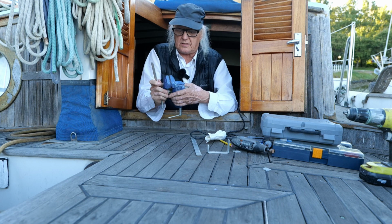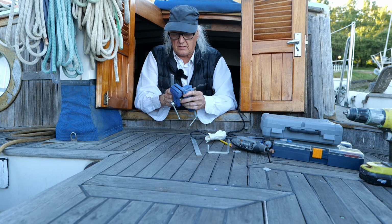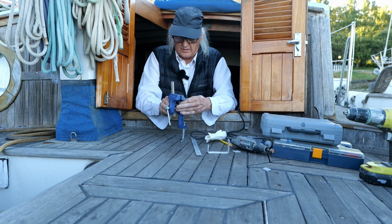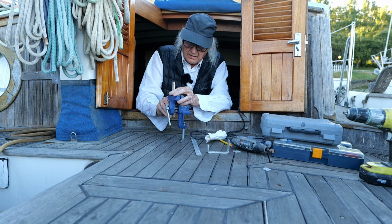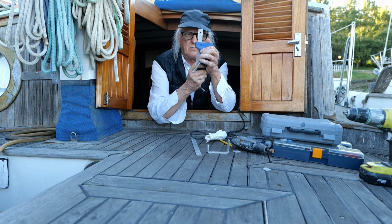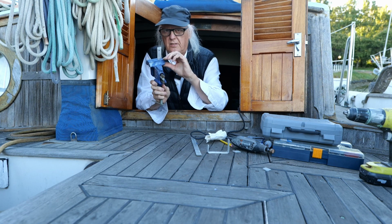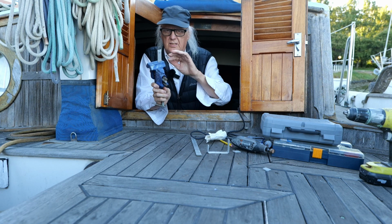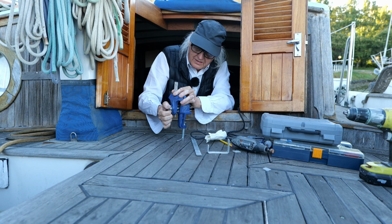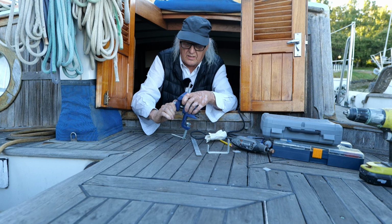So let's see which way would be easiest. If I'm going to hold it in my hand, I'm going to hold this and pound it with another. So I think I'll pound it in this direction. So I just got to put this in. Now I'm just going to make sure that I have it in straight up and down in the vise. And I'm going to have the line that I drew sticking up a little bit higher than the vise, because if I put it flush, then it's not going to bend in the right place. I've done this before and I know what happens when I do this. So I'll just make sure it's straight so it'll bend straight. Now I'm just going to get a hammer